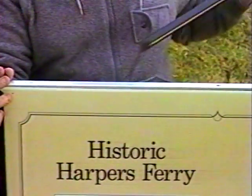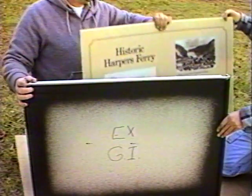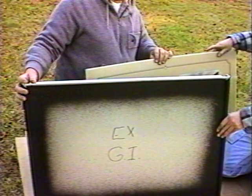Drive rivets can also be removed if necessary by drilling off their heads with a 1/4 inch bit. Do the same for the remaining drive rivets. Lift off the loose retaining angle and slide the panel out. To replace a panel, first make sure the frame grooves and weep holes are free of dirt or other obstructions. Slide the new panel into the grooves.